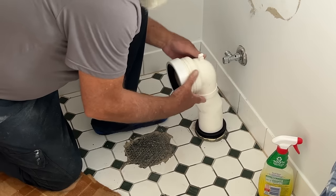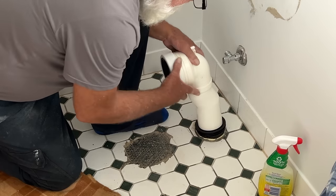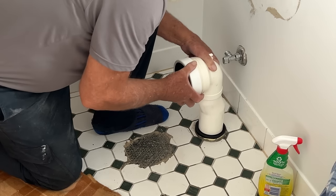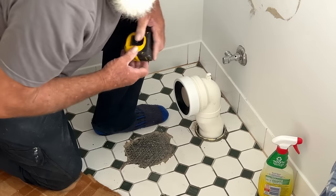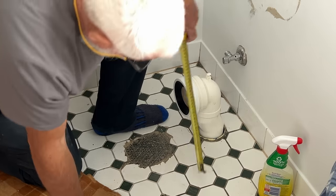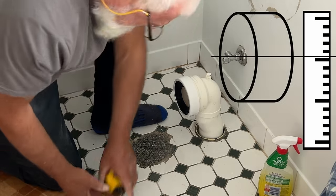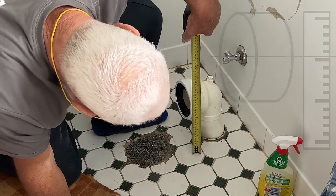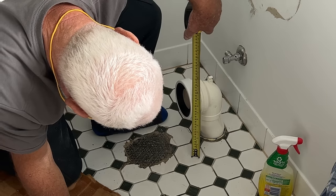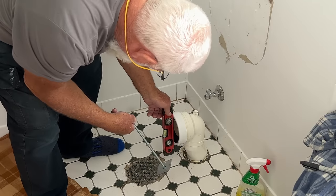This one has an offset, Lee tells us. If need be, you can twist it around because of the offset to suit — it gives you a little bit of side-to-side adjustment. Push that down. It should be 185mm off the floor to centre. He's now checking that he's got the height right; from memory it was 180 to the centre of the pipe. That's the height that the outlet comes out the back of the toilet bowl. We want to make sure that the pipe is flush, or level.